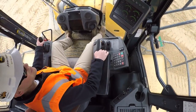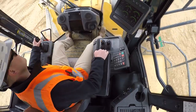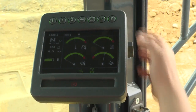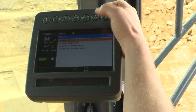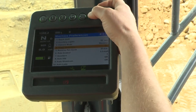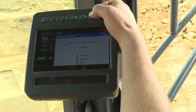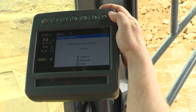If operating over rough, unimproved surfaces, lower ride control speed settings are recommended. If the machine is exhibiting a rough ride, you may lower the speed setting to allow ride control to come on during this behavior. To adjust the speed at which automatic mode turns ride control on and off, navigate in the monitor to the main menu, Setup, and Machine Preferences. Scroll down to Ride Control and adjust up or down to the preferred speed. The speed is set at 3.5 miles per hour at the factory. This speed is acceptable for many applications. Higher speeds may be used when operating over improved surfaces.